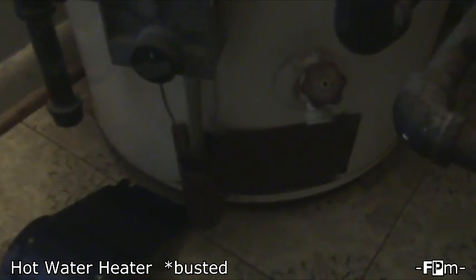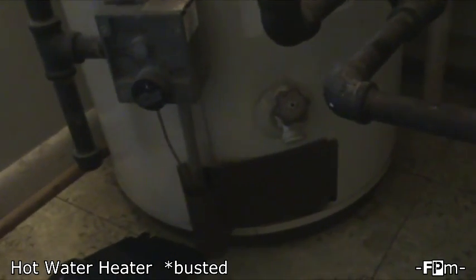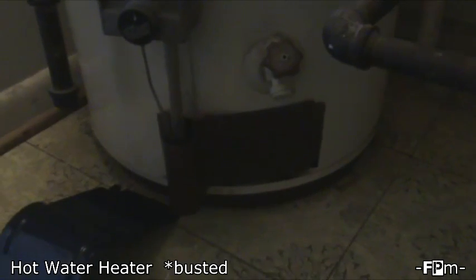But you can see where the panel is right there, that brown one, it's actually on it, right above the outlet valve. And as much as I have do-it-yourself stuff on my channel, I was not going to try to replace this. So all I did was stop the water from leaking. I turned off the valve on the top to the water heater so it would stop filling up. And then, like I said, I emptied it.